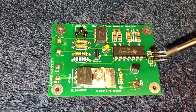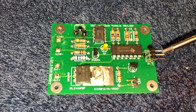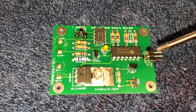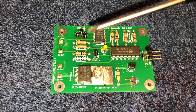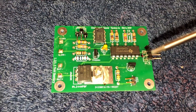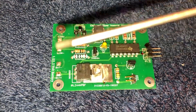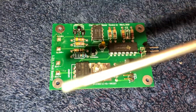The card has power fed to it from the receiver battery, or you could feed it straight off the receiver. The card does not use a signal from the receiver — it's just hot and cold. It can run anywhere from a 4.5 volt battery up to over 8 volts without any issues. The other side of the card is the glow driver component, where you connect the glow driver battery and the leads to go to your glow plug.